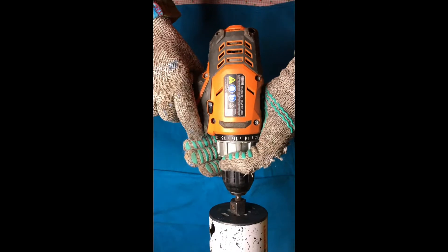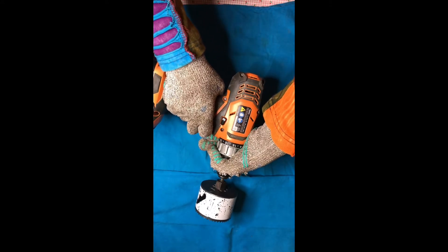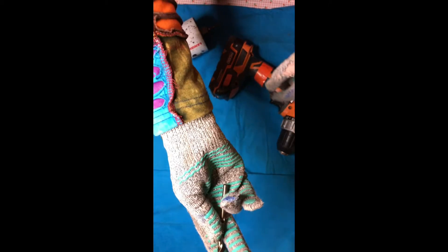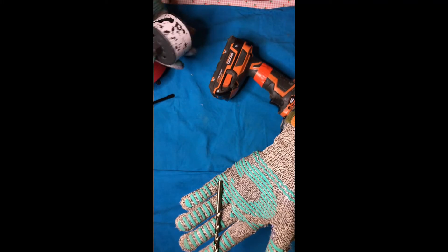When done drilling, put the drill back into reverse, hold it low to the table with a good grip, and the bit comes off nice and safe. You might wonder how I got such a nasty tear in my glove — it was actually from a twist-style drill bit, not a hole saw. If you're using a bit like that, it's not good to wear these gloves because the fabric can get caught, twist, and cause a nasty cut. These gloves are great for hole saws but not for that type of bit.